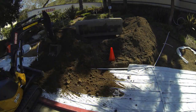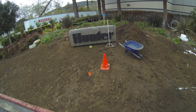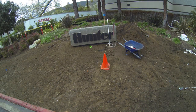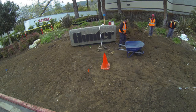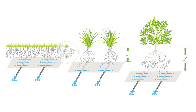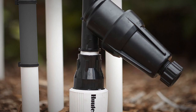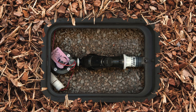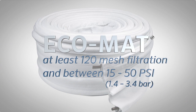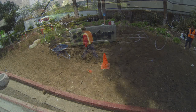We add the soil on top of the Ecomat. The soil needs to be clean, free of debris and large rocks that could potentially cause damage to the Ecomat. Once filled in, we level it off and work towards an even compaction of about 80% to ensure uniform movement of water within the soil. Overall, the Ecomat should be between four to six inches below the surface for turf applications. All drip irrigation systems, whether at grade or subsurface, should always have appropriate filtration and pressure regulation. The Ecomat requires at least 120 mesh filtration and pressure regulation between 15 to 50 psi.